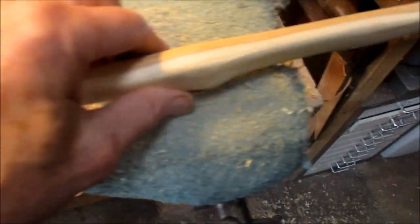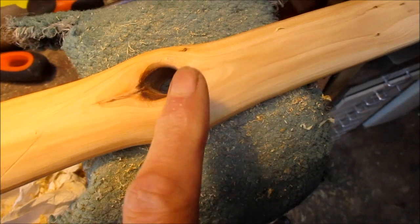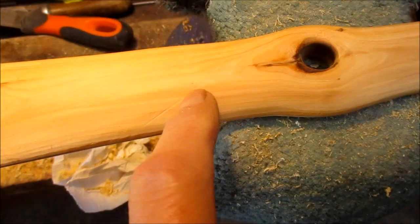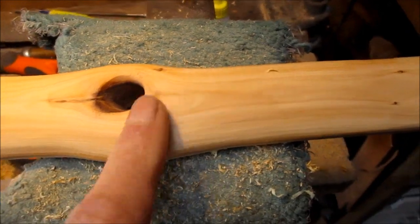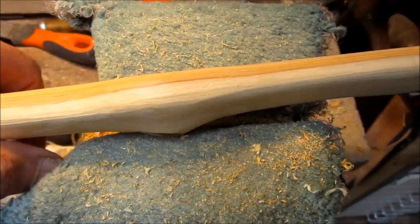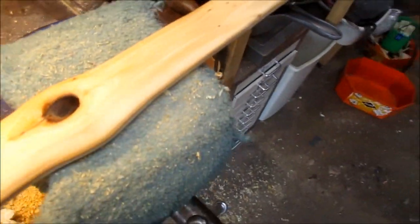It's tempting to say she's just too fat there — too much allowance around this knot — and that may well be the case, but I'm reluctant to turn that into a weak point. Somehow I've got a score across there that will come out with the scraper. So it's quite thin there and just bulges up around the knot.